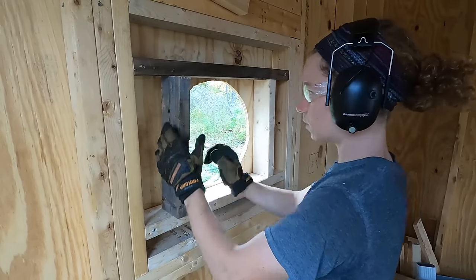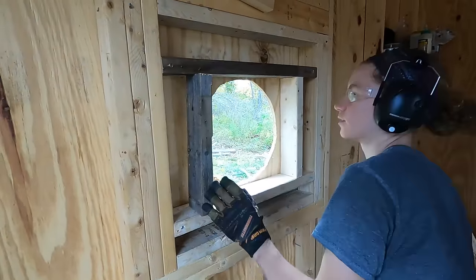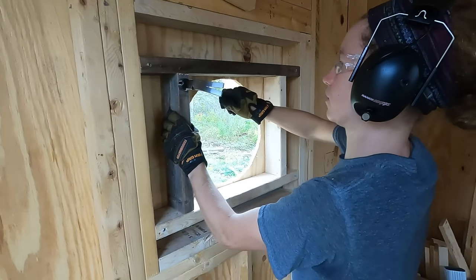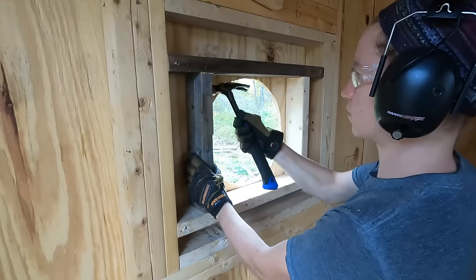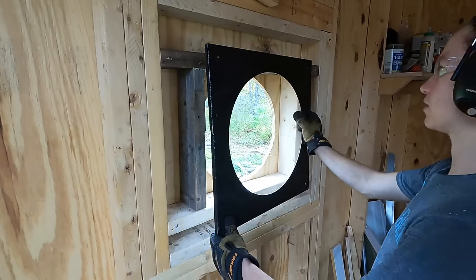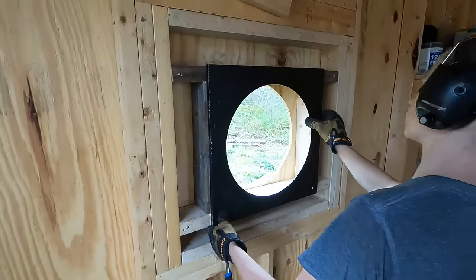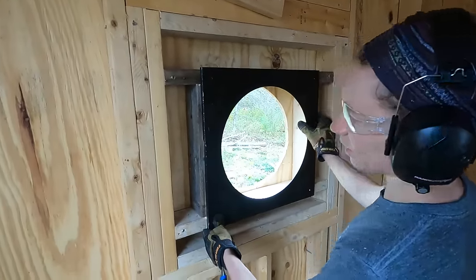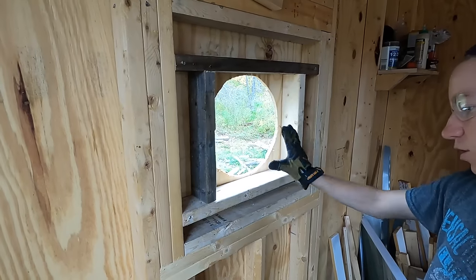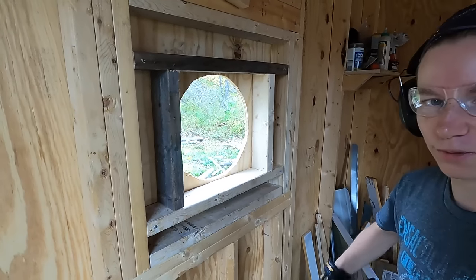Just for the thimble, and it adds structural strength to the wall. So, if you're doing your own wood stove install, it's through the wall, you will need some kind of support for the thimble. And probably won't look like ours because you won't be going through a window. But this is what ours looks like. There's a lot of framing here just because they had to patch this piece in, but at least we'll know the chimney will be supported by the wall.